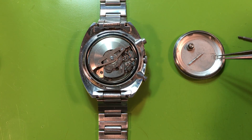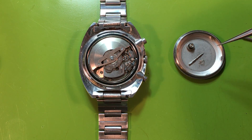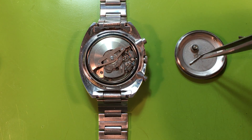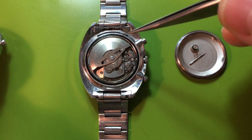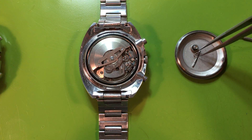Here's the remains of your broken stem. The gear is missing, which is really weird because the spring was in there — the spring should be outboard of the gear, the spring was there but the gear was gone. Anyway, broken crown. I did take the donor watch here and I pulled the stem on it and I put the stem in here and it works fine. So we can assume that that's going to be great.